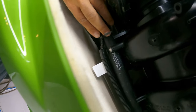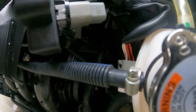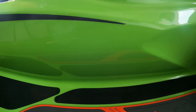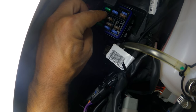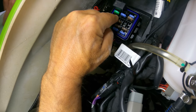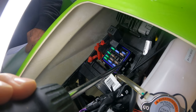I put in a tie strap here and another one here; I'll put one more over here once I'm done installing the bilge pump into the fuse box. On the cap of the fuse box right here it says 'bilge pump' — that's where we need to connect. One wire goes to the positive terminal there, and the other one goes up here to be grounded on the bus bar.